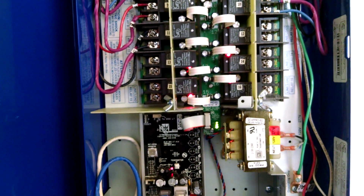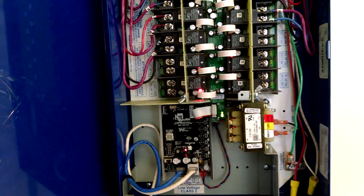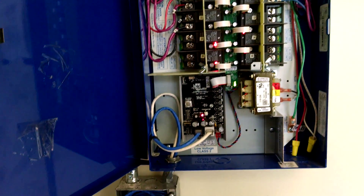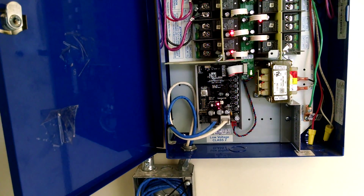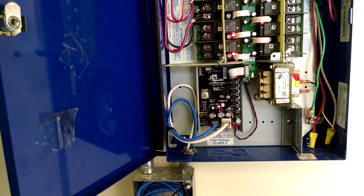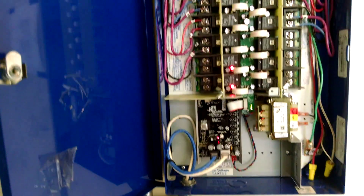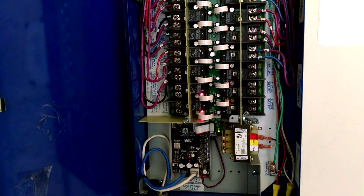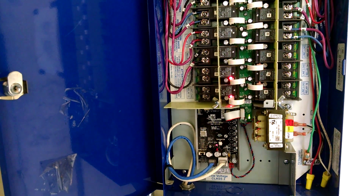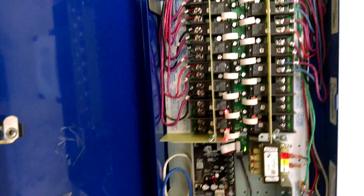The bus — incidentally, a bus is just a piece of cable that connects intelligent pieces of equipment together in a building. The bus in this case is a piece of Cat5 with RJ45 connectors. The bus runs through the two Chelsea switches, which I'm going to show you, and into this control cabinet. It goes out of this control cabinet to the master relay cabinet, which I'm going to show you next, and then to other Chelsea switches or other equipment you might have in the building.